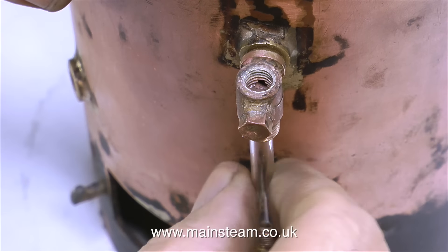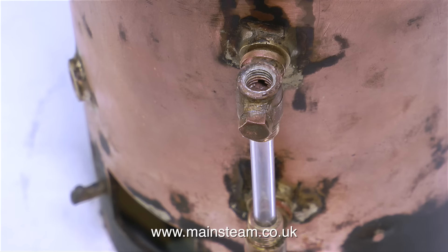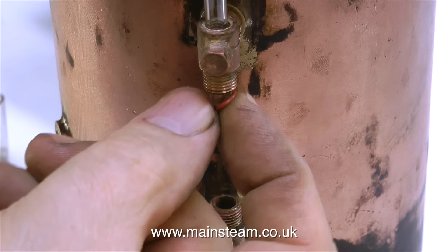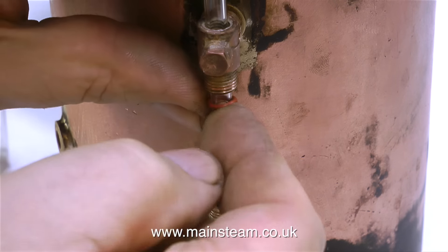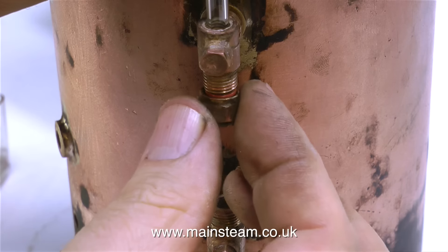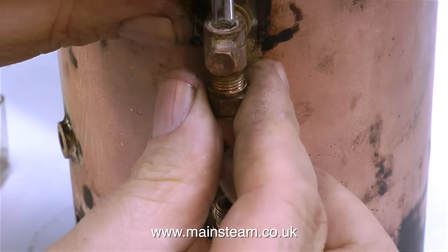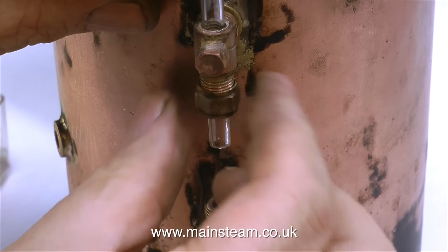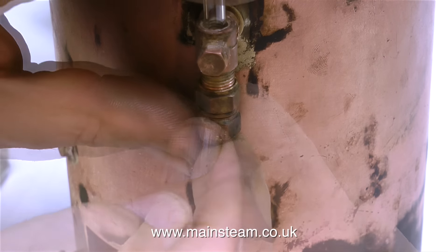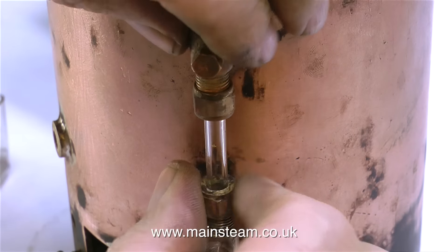Now you can clearly see the gauge glass fits perfectly, and you can see the hole through into the boiler. I'm putting an o-ring on the piece of glass. If the edge of the glass was very sharp and pointy and jagged, then I could bleed profusely onto the bench — but it's probably best to avoid that. With the o-ring now on the piece of glass, I can put the nut on, then put another nut on underneath, and put another o-ring underneath the glass. Push the whole assembly down and then tighten up the bottom nut.